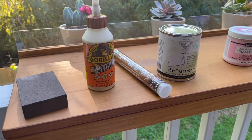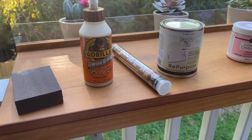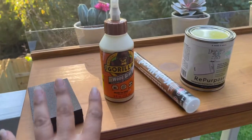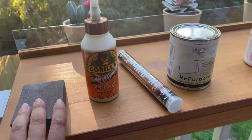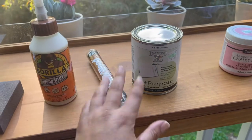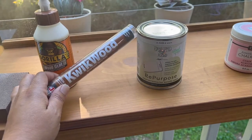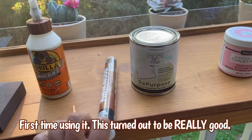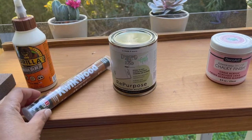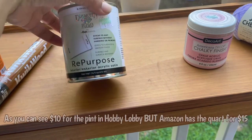All right guys, so let me just go ahead and show you briefly what I've used and what I'm using here today. I got a good old sand block. You can use sandpaper, whichever one you like. I grabbed this one from the Dollar Tree because it's quick and accessible. I also used the Gorilla wood glue to fix the head and a couple of other loose parts on the horse. I already did this part. And then, because there were a couple of pieces actually missing, I used quick wood, which is like a putty. I fell in love with this product first time using it. After you use it, you can sand it, staple, hammer, do whatever you gotta do once it's fully cured. I'm gonna go ahead and link that in the description.